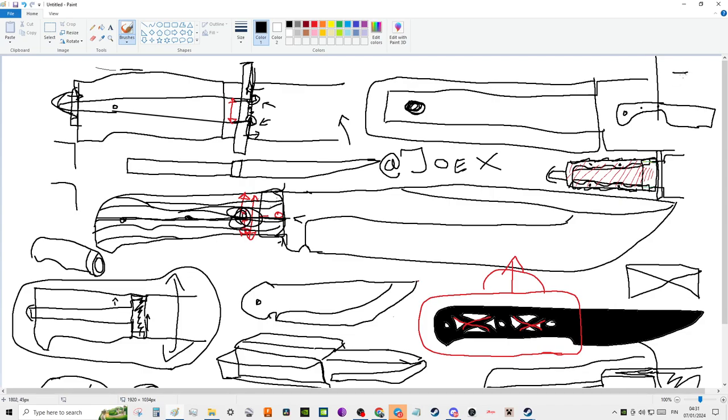And of course, you have two separate structures. That's probably not the best way to explain what I'm about to explain, but when you have this, you have two separate areas, and you just have a massive loss in material. So you've got to be careful with your pins, and chances are you're probably better off having smaller pins. And again, this really depends on what materials you want to choose for your handle, how strong you want the blade to be, and how light you want it to be. These are all things you've got to take into consideration.